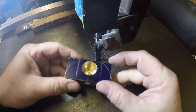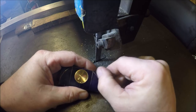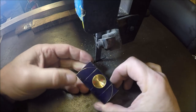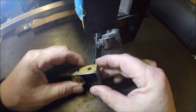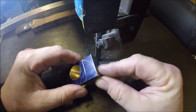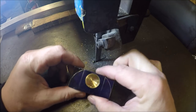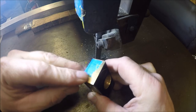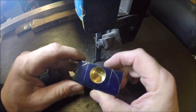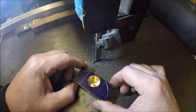So I'm going to go ahead and use the bandsaw to take the majority of this material off. Then we'll take it over to the belt sander and work on that radius. And then finally, to get the final dimension and a nice surface finish, probably file it. This is a 1943 do-all ML-16. Let's go ahead and get some material removed.